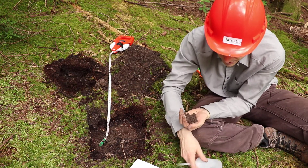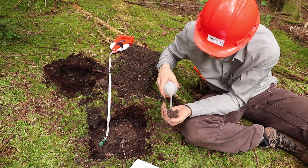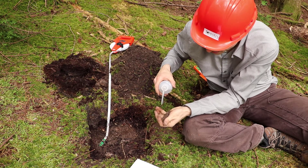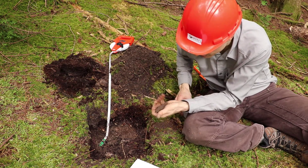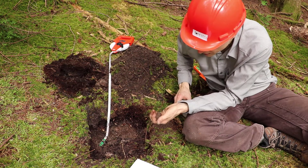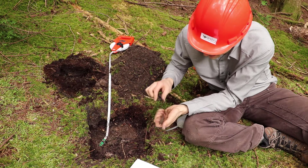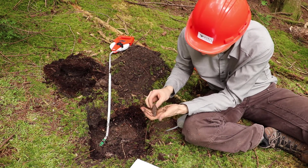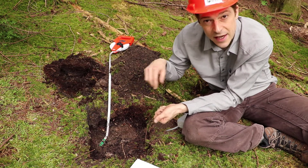Moist cast test — let's see if we can make a cast. I'm going to get some water on here. Whenever I make a cast, I really see all of the coarse or fine particles that I failed to remove. So here's our cast. This actually makes a better cast than the other soil did, and I think that's because there's less sand in here.